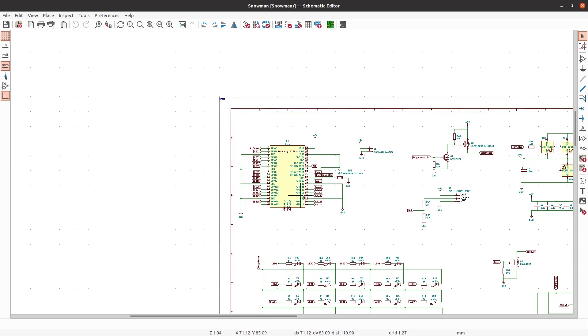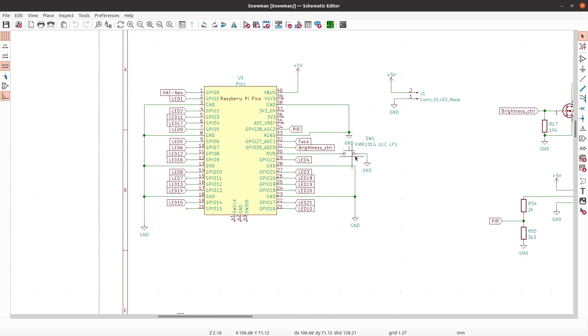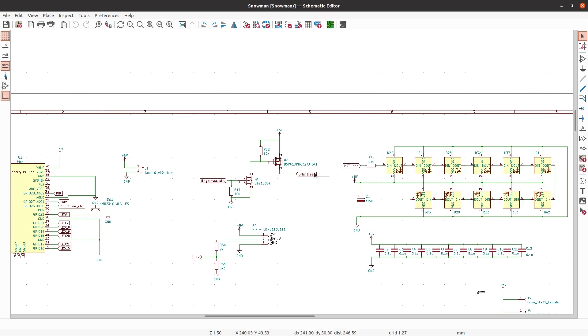I've got the idea for this project — I just need to get a PCB sent off to be made so I can put all the components on it. So let's have a look at the schematic and PCB design. I've got the Raspberry Pi Pico W here, which saves me having the ESP that I had last year. I've connected up a button for reset and connected all the legs to the pins I want. I've got my power connector and brightness control this year — I wish I'd done it last year. I've got a control line coming from the Pico which will be a PWM signal, switching on the 5V brightness PWM, so the PWM duty cycle will control how bright the LEDs are.